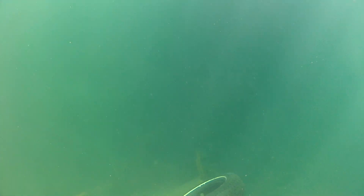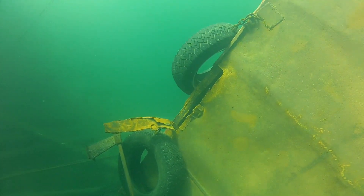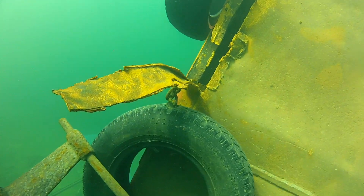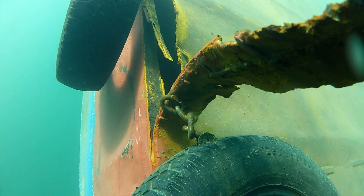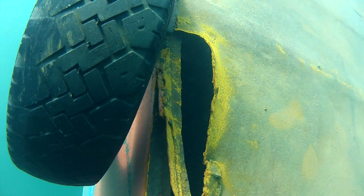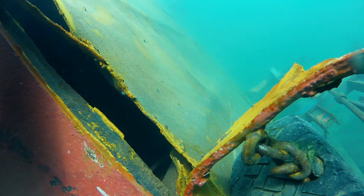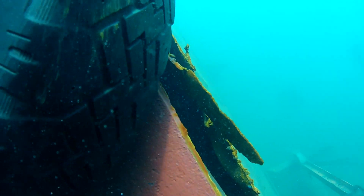While we're down, you can see a little concrete patch on the corner that we put in. You can see down on the ground there's a whole bunch of steel piping that was on the barge. This is a damaged area — that's where we're going to be cutting. We're going to cut off that little piece that's sticking up so we can put a piece of steel over top of everything, j-bolt it down, and then grout it in place. Basically, we've got to seal all these holes up so we can either pump the water out or inflate it with compressed air, displacing the water inside the barge and making it buoyant again.